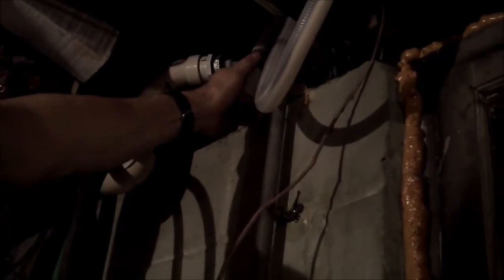That was my hose clamp dropping off of my waste pipe. I got the water back on already. Now, I haven't got any flow to the dishwasher yet, which interestingly, brings up an issue. This particular dishwasher, using a solenoid on the hose, means that there's no pressure getting into the dishwasher at all, unless the dishwasher turns that solenoid on. So there's not even water pressure up in the kitchen. And that's part of the reason, I think, for their guarantee that it doesn't flood, because they do have a flood statement in their literature.